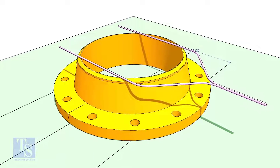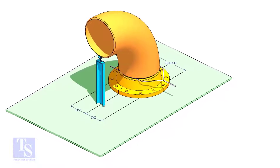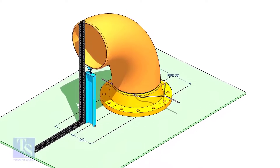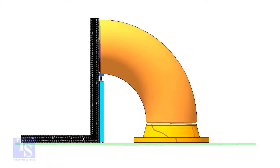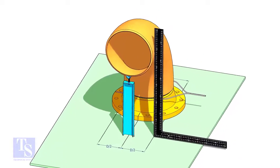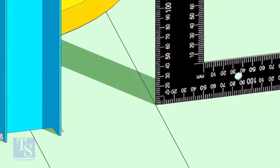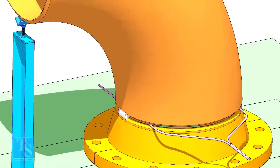Put the gap rod and elbow on the flange. If required, make an adjustable support to hold the elbow in vertical position. Make the squareness of the elbow to the plate — the straightness of the plate is a must. Make sure the face of the elbow and the lines are parallel. Tack weld on all four sides.